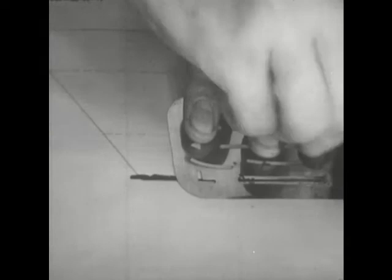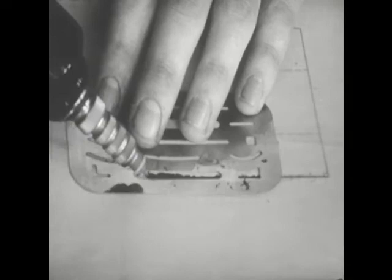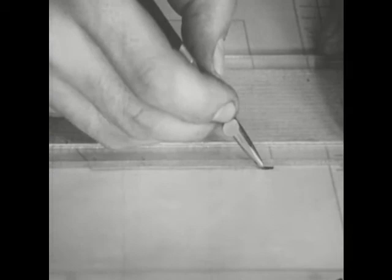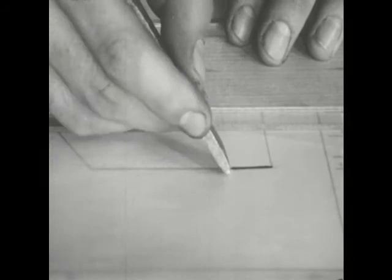An erasing machine is effective for removing drawing ink. It must be applied intermittently to avoid overheating the rubber and causing smears. The dirt produced by erasing must be thoroughly brushed away to avoid clogging the pen and causing more trouble. The use of improper methods of erasing damages the surface of the tracing cloth, causing the ink to spread and make a rough line. Rubbing the eraser with a soapstone will make the cloth take the ink properly.